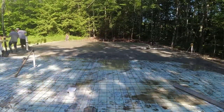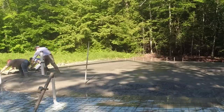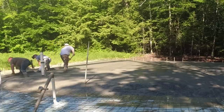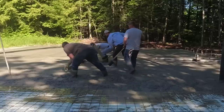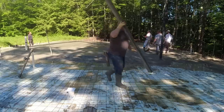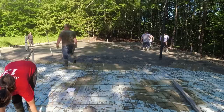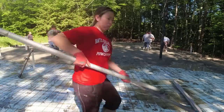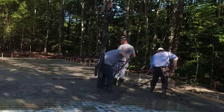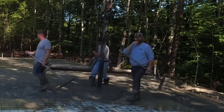I've got the wire puller in hand — we're pulling the wire up as we pour and working the water out at the same time. There's a little 2-foot bump-out area we just screed with the 14-foot screed, then get all our pads struck again. As we strike off those pads, we're looking at the wet pad and the part of the floor already screeded, using the magnesium screed to get the concrete level in that spot — about 2 feet wide — to give a good flat reference for the power screed.